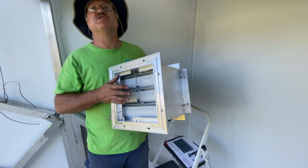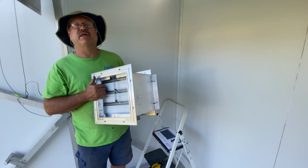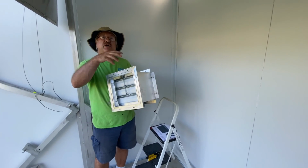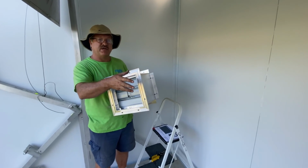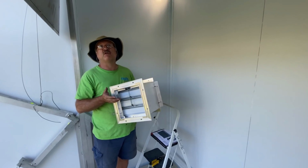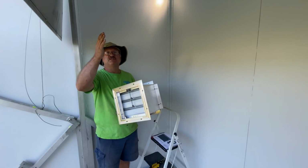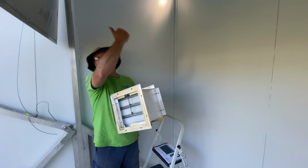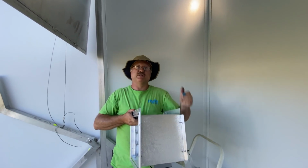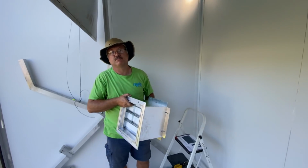Perfect. We always mount the powered vent that is blowing out on the rear side of the kiln, which is basically the same side as your L200 is, or we call it the negative pressure side of the main blower fans. So if your main blower fans are blowing in that direction, your powered vent will blow in that direction. Perfect. Okay, that's easy to understand.